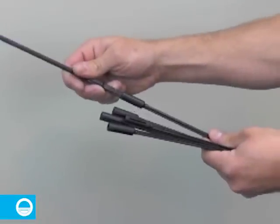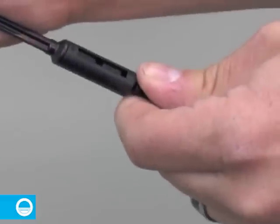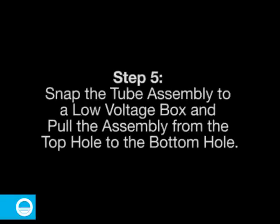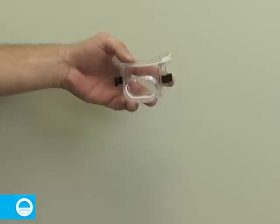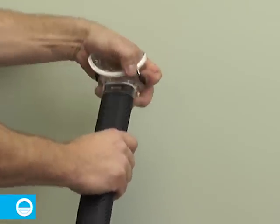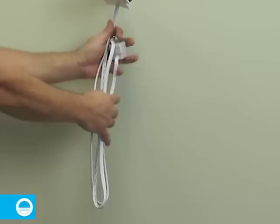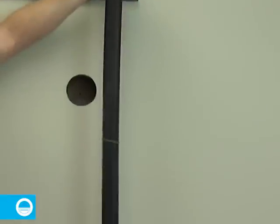To assemble the fish stick, align the ends and push them together until they snap. Repeat for each section. Notice that there are gaskets in the tube port of each low voltage box — make sure they are completely seated. Insert the tube as far as possible. Straighten the NM cord and use the rubber bands to secure the NM cord to the back side of the tube. Leave some slack between the top receptacle box and the low voltage box.